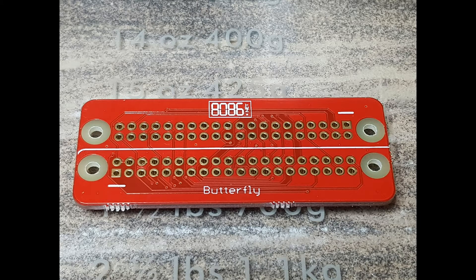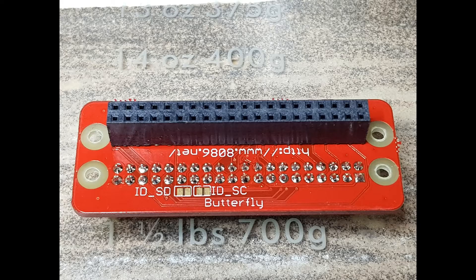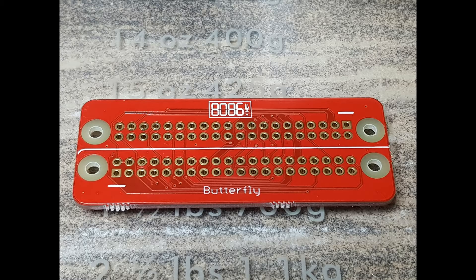The Butterfly board allows the Raspberry Pi to have two hats or HATs connected at the same time, assuming there are no conflicts. In comparison to similar boards like the Pico Hat Hacker, the Butterfly board is designed to be used with a female header with long pins on the Pi going to the first hat, and the second header is spun around 180 degrees to allow the second hat to be plugged in facing the opposite way. So pin 1 connected to the Pi and hat is on the bottom left, and pin 1 of the second hat is on the top right.